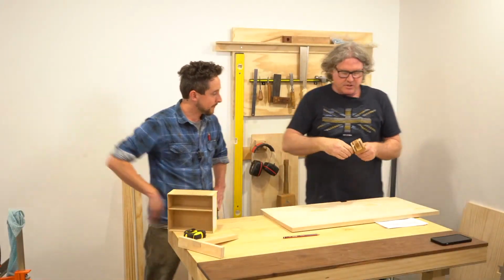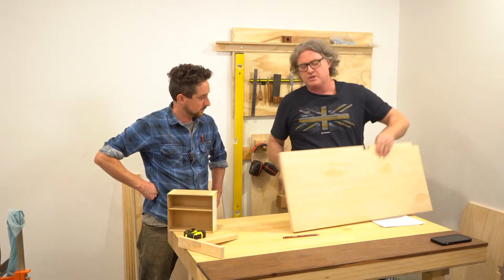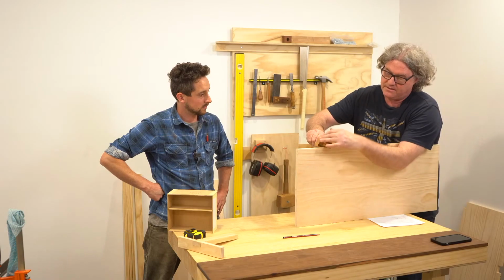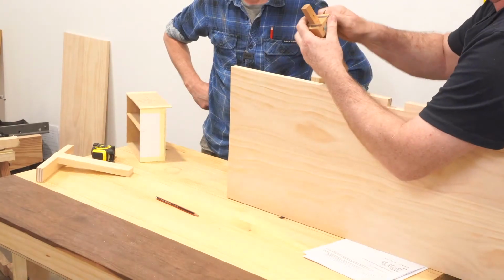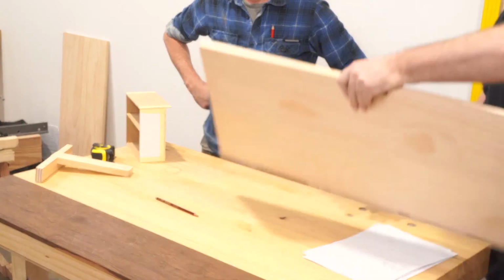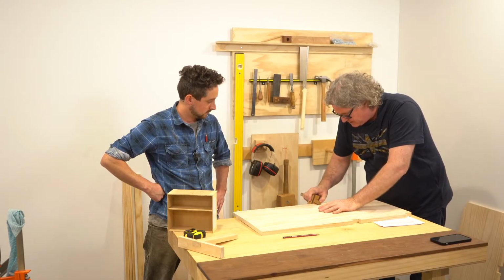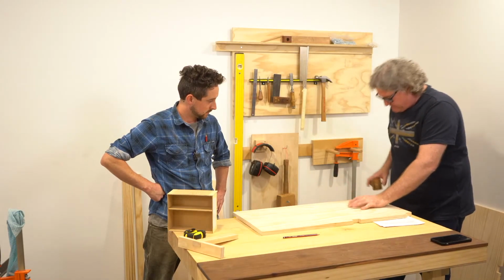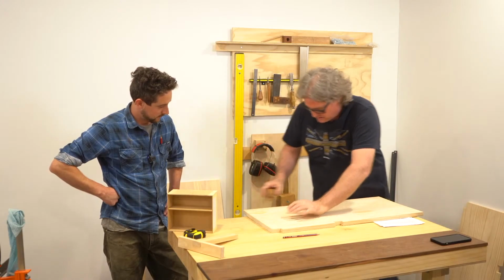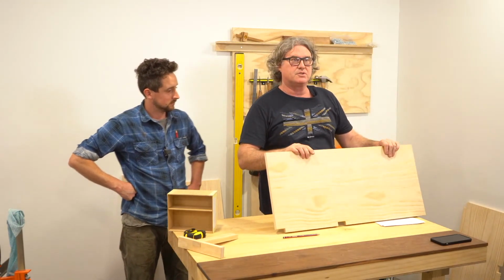Yeah, that's right. The next thing we're going to do is use our scribe to mark the depth of the rail notch. Now, I know it's 19mm being store-bought timber, but I can actually measure this straight off the thickness of the timber, like so. Soft tighten, a little bit of an adjustment, and that's going to set the depth without actually having to go to the ruler. Speeds everything up a little. Mark that there, drawing it towards yourself. Flip it over. And there's your marked out joint.